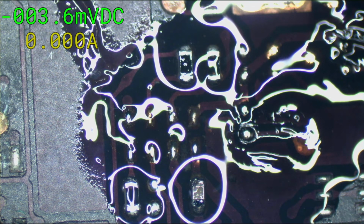No, you don't want more running away. All you need is what's underneath your work area. What you're working on needs to be covered in flux, and that's it. If the flux is a centimeter away from where you're working, because that's where you blew it, then it's not doing anything over there. It's just a waste.